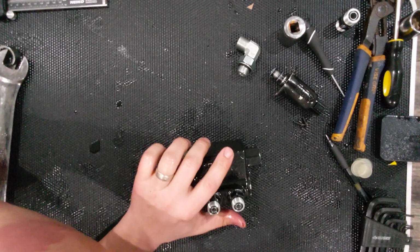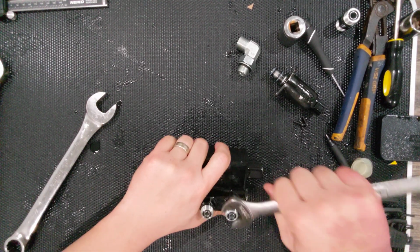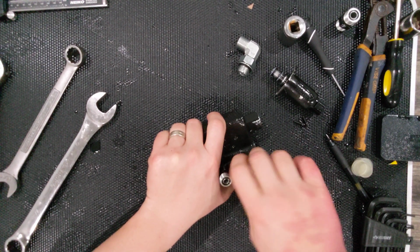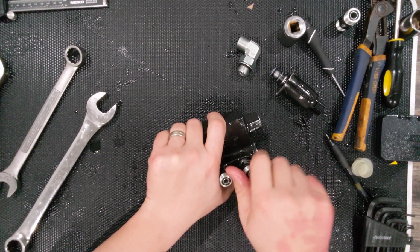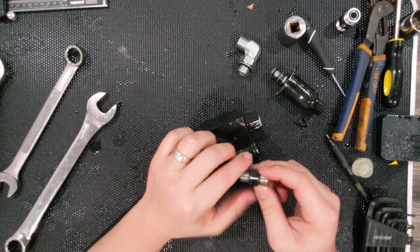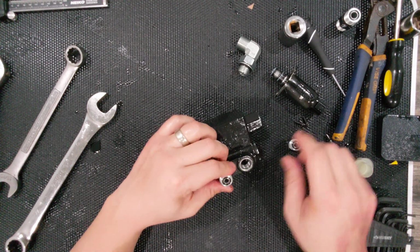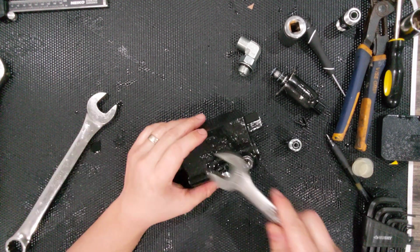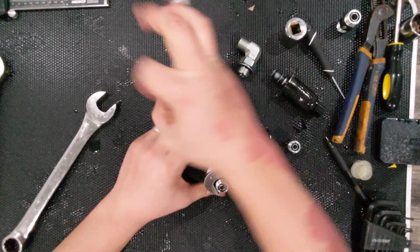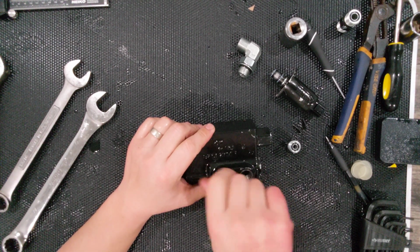And what size is this here? That's close enough. So these are just straight O-ring boss to O-ring face seal. They're both -6. Just to show you what these are, so there's your O-ring. This snugs down, and you don't have to crank these things down. The O-ring does a lot for you there. This one might be a little bit tighter. Ooh, I'm trying not to shake the camera. So I'll pull this off.